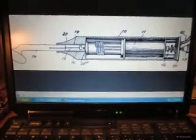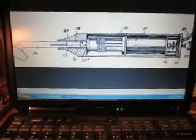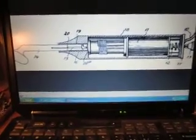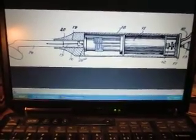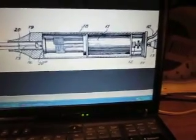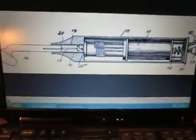I have had no chance to test and see what they do or how they work. I know some details about the frequencies and the way they are built. Anyway, this is the diagram of one of the old devices. As you probably guess, I'm talking about the violet ray device, which incorporates a Tesla coil in it. These early devices had a mechanical interrupter, and that was the entire wand — a hand-held wand.